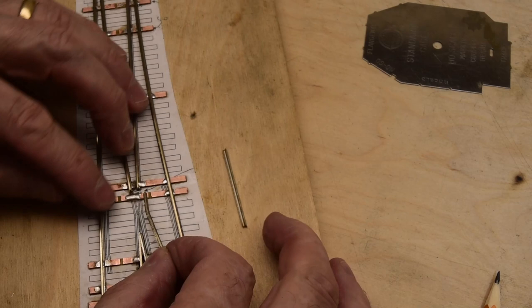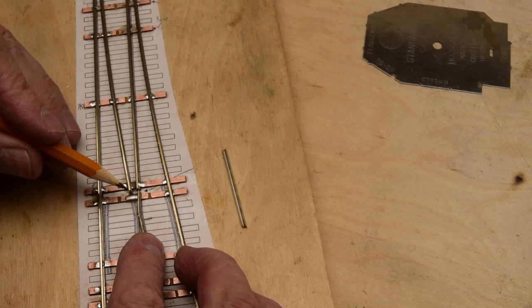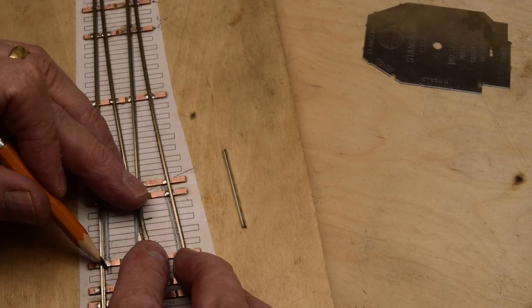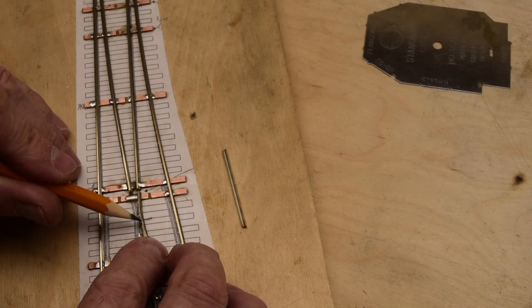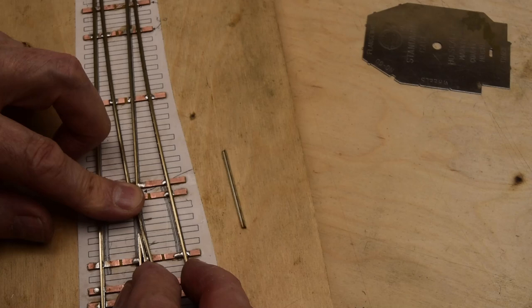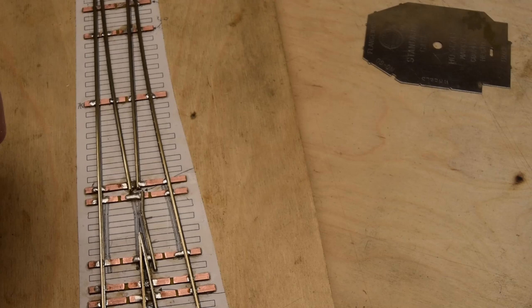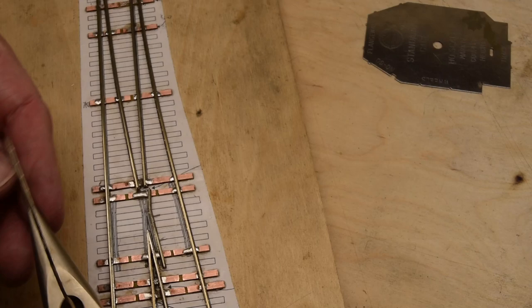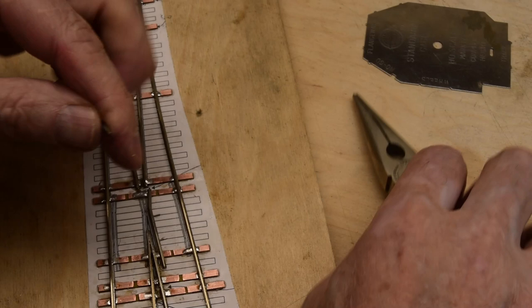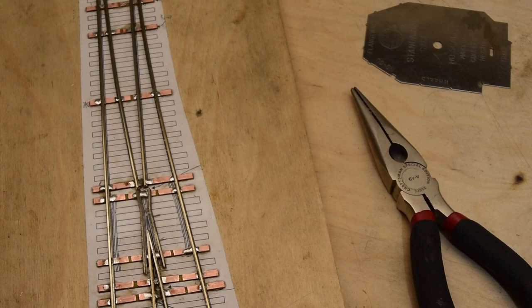These are the frog guard rails. Now, they're an extension of this point rail too, right? Okay, so they run a ways yet along this rail, the wheel, before it catches the frog, see? And it rides along this offset angle too for a while, and then catches the frog. So it looks like it's a big gap to jump, but once they're in place though, they roll over quite smoothly. That's how those go in.